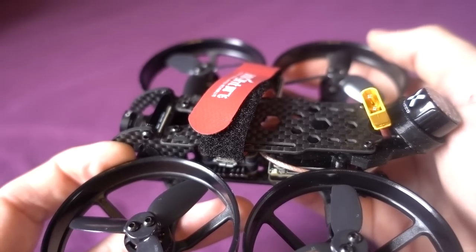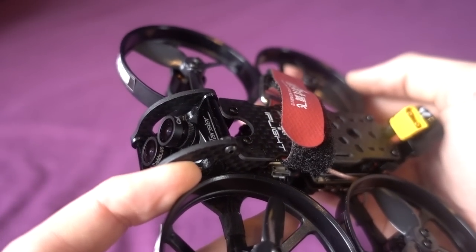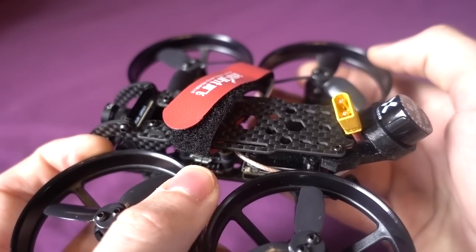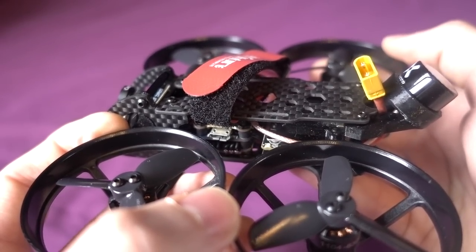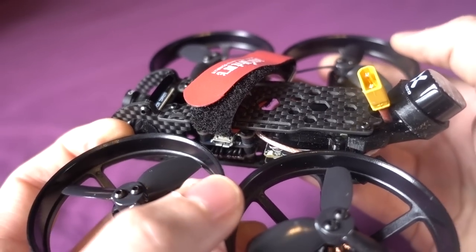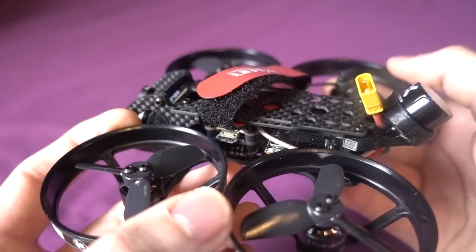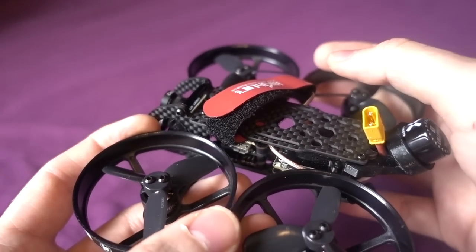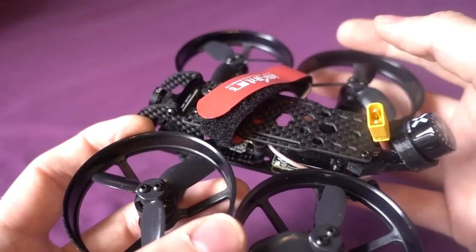The on-screen display layout is in the middle of the screen, which is a bit strange. Of course, with the USB port broken, I can't change that now. There are no spare UARTs, and it's using a virtual COM port for the USB, so it will take a lot of messing around to get the USB working again. And if I were a customer, I'd just be sending it back. There is no current meter, and they have got the RSSI turned on in the on-screen display, but it's disabled in the receiver tab.